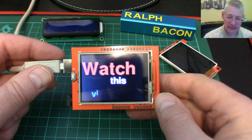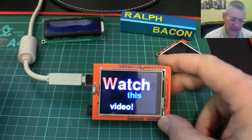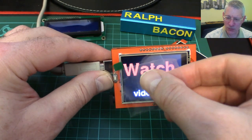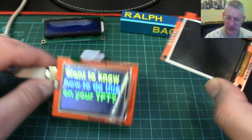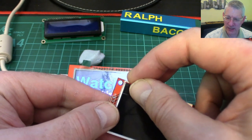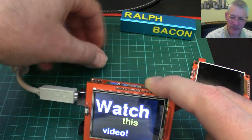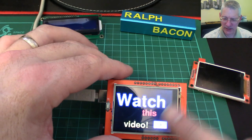Lots of people have got the display working but not the touch — and touch does add extra value, at least for me. Let's have a look at the code. The touch sensitivity — minimum and maximum pressure — is up to you. If you want the lightest touch you could set the minimum to 2 or 3, but as we know from analog inputs it can be a bit noisy. Zero means no touch, but you don't want it to trigger when nothing's happened, so it's set here to 10.